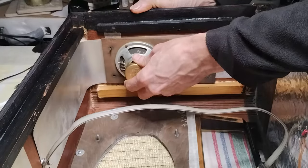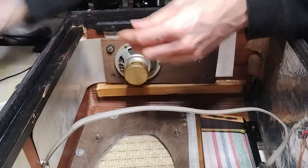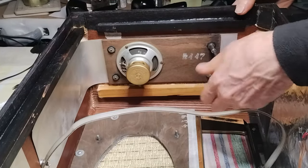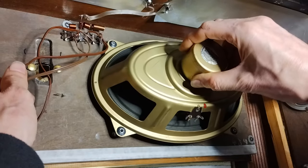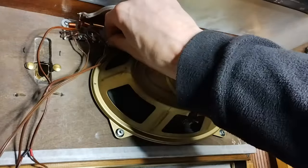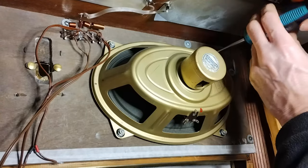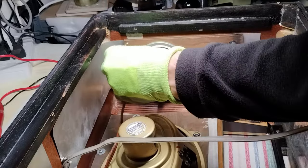The three loudspeakers were then installed again in the cabinet. The lateral speakers used some rubber washers that were replaced by cutting small round rubber pieces from an old bicycle inner tube tire. The connection to each speaker was done respecting the original polarization.